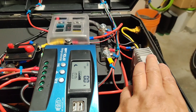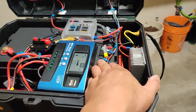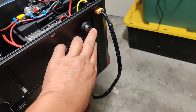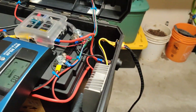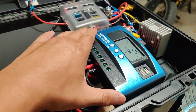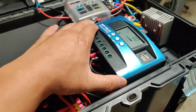What I've done since then is added a DC-to-DC converter which converts the 12 volts in this lithium iron phosphate battery to 24 volts, outputting through an XT60 port. I also added a switch to turn this port on and off. One thing I did find is that this is not actually an MPPT solar charge controller — it's branded as MPPT but it's actually a PWM charge controller.